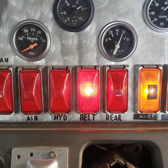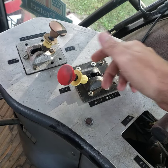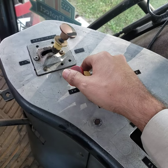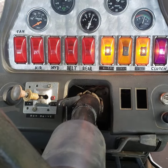'Belt' — that is our box belt light. All that does is this controller right here: it's a PTO flipper controller from a semi. It's in right now. Flip it all the way over, that disengages it, and the belt light goes off.